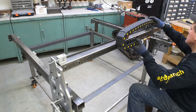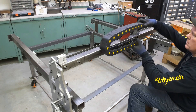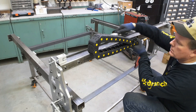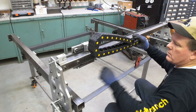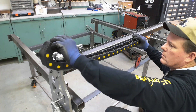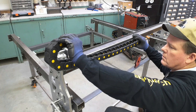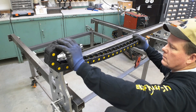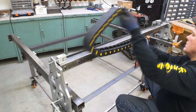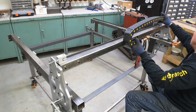Next I start eyeballing the location for the x-axis — this carriage is a cable track. Although I'm not going to use the hole that I had drilled in the gantry tube, if you watched the last video you know I can't get in the ends of the gantry tube anymore. But I know that's roughly where the track is going to fall, so that's why I'm holding it right in the same spot with my right hand, getting an eyeball for where it's going to go on the x-axis. We haven't made that bracket yet and that's coming up in just a minute.